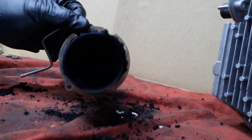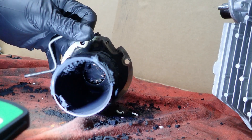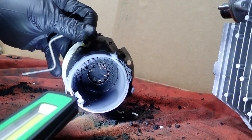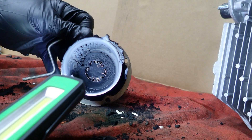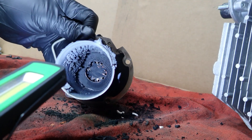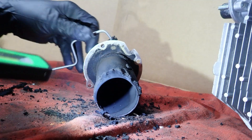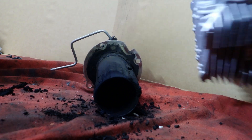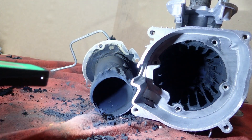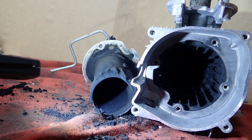Let's see inside the burner — you can see little bitty ports in there and it's pretty much all sooted up. It's not clogged down in there, but it is sooted up. This pretty much shows that you need to use a fuel treatment — some type of fuel treatment — to treat the fuel, to keep it from gelling up and keep it clean.